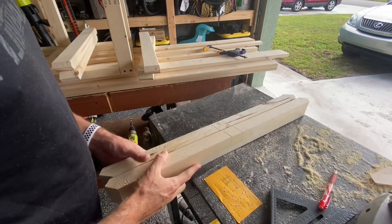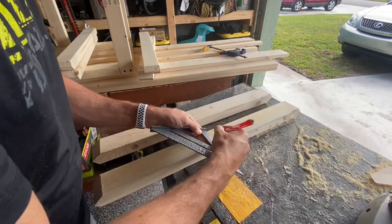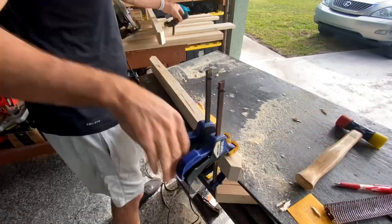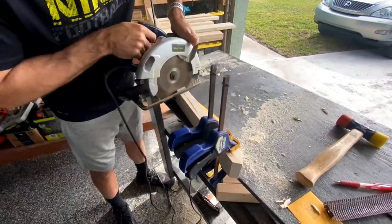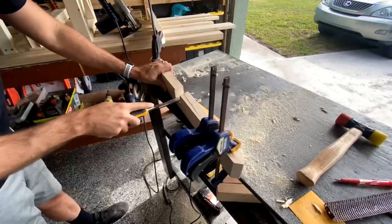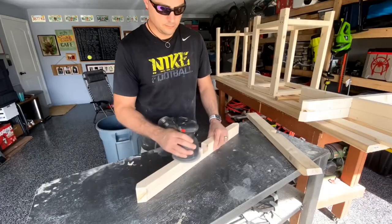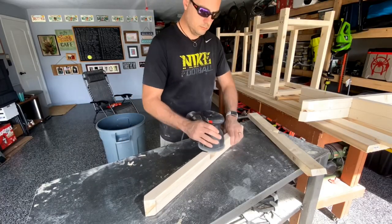When you have these locations for the slots, you can clamp the whole thing down to your workbench and cut a one and a half inch deep slot out of each by slicing ten or so close cuts along the angle you just marked. You can then literally pop these little flaps out with your hand and just clean it up — it gives you a nice smooth fit.